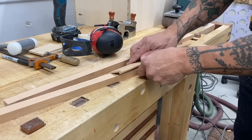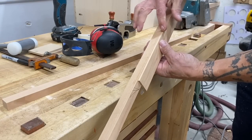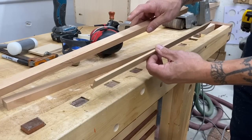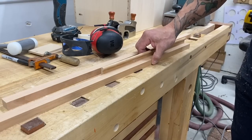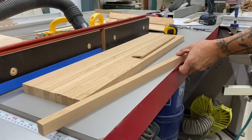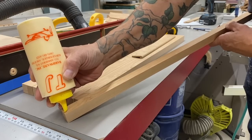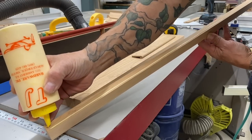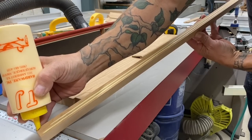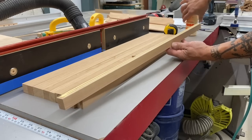I'm going to put a bead of glue close to the front, but I don't want it to migrate past the front — it'll just be glue I'd have to clean out. Down the middle, the majority of the glue I want in the back, because I want that part to squeeze out. Now, this applies to a lot of situations where you're applying one piece of wood to another. Rather than just plopping it straight down, which would allow glue to migrate toward the front, what we're going to do is put this piece of wood on like this and squeegee that glue toward the back.